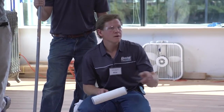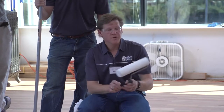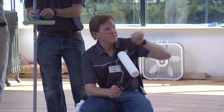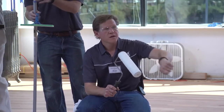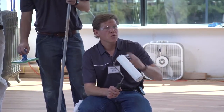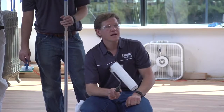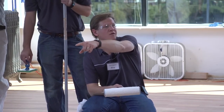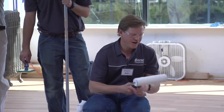So at this point, you can wash out that roller? Yep, so I would rinse this out. A 5-in-1 paint tool that's got the roller curve on it works great. You can kind of get all that excess finish out of there, rinse it out, put it in my container. Now, one thing I didn't do that I would have done on the job is that container wouldn't be over there in the homeowner's kitchen. It would be at the door where I'm walking out, right?